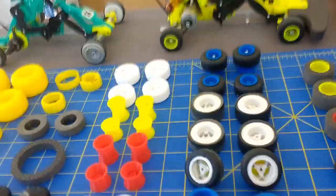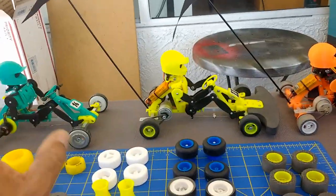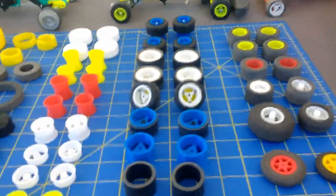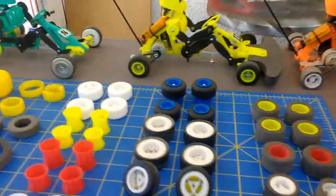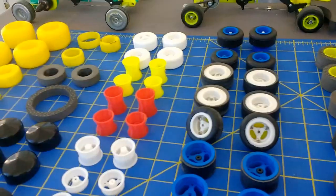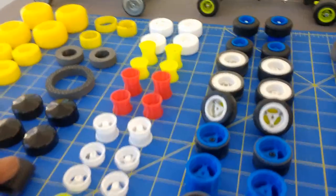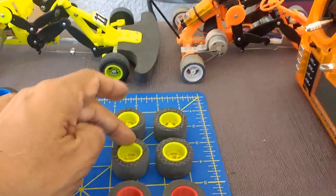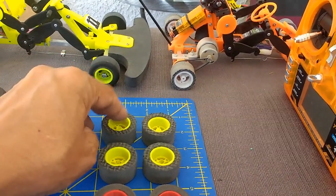In this row we have the foam section - these are foam tires, with 3D-printed hubs. Everything you see here, including the carts, is my own design. This is not the only set of wheels I've done - it's to locate the best wheel for these particular products. I've done all these and more in various materials: rubber, foam, vinyl, inner tube, real rubber, and I've even tried O-rings as a tire form, but O-rings don't work in these types of cars. This is the playground mat material - the real thick stuff - a little tricky to cut.